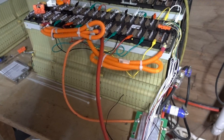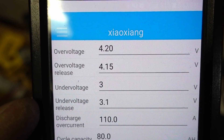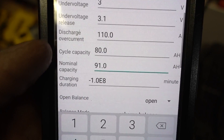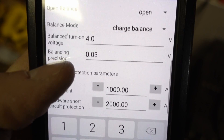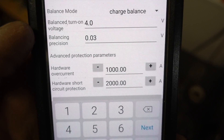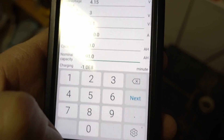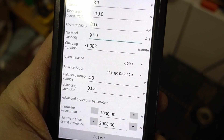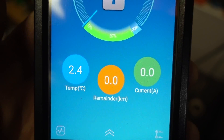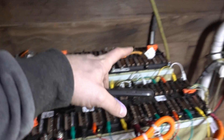This is a really nice program with this BMS board — you can set all your own parameters. I got my overvoltage set to 4.2, and I put in how many amp hours my batteries are. You can set when you want it to start balancing your cells — at four volts it starts balancing, which is amazing. There's gonna be lots of updates on this because I only have this one little block hooked up and I still haven't got the 24 volt sections hooked up together yet.